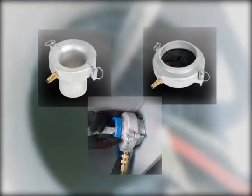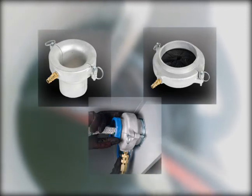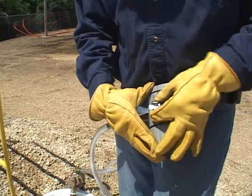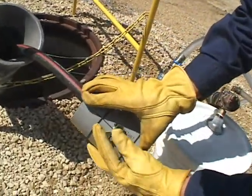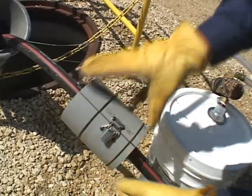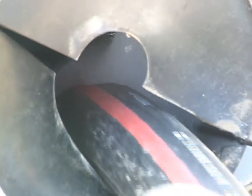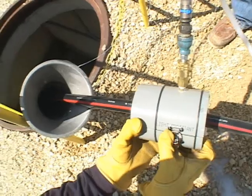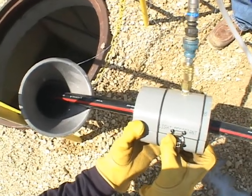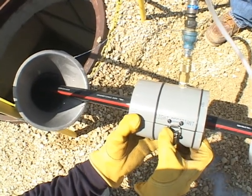There are several different types of lubricant applicators that you can use to apply Polywater lubes to cables. Open this split device by releasing the hasp in the middle of the applicator. Place the device around the cable or wires and refasten. As lubricant is pumped into this applicator, the internal applicator flaps coat the cables as they pass through. Control the pumping rate to completely coat the cables but not overfill the sleeve. Lubricant applicators can be used in horizontal or vertical applications. Gel lubricants are recommended to prevent lubricant dripping.